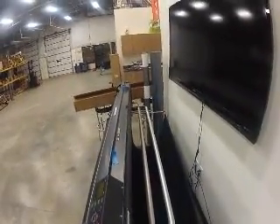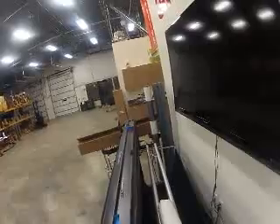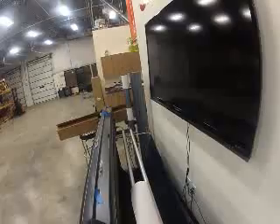On the back side of the plotter, you're actually going to see you've got your media rollers. I've just got them straddled in the widest position. I'm going to go ahead and set my roll of film on the actual media rollers, so it's going to feed off, and then I'm going to feed it under and get it aligned on the actual plotter. I'm going to roll this out and feed it under my actual grit rollers.